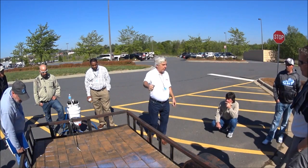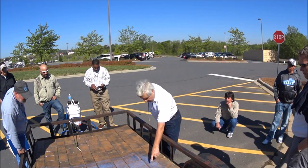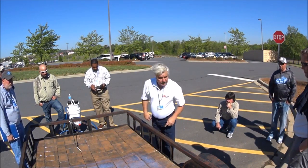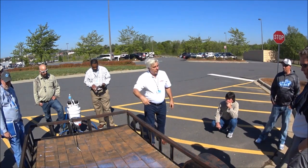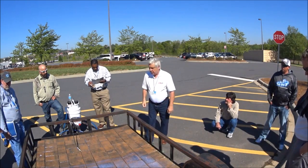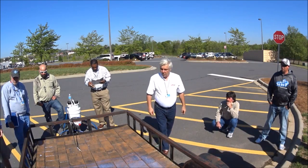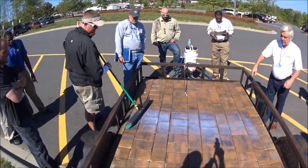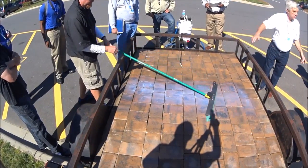When I'm doing my second pass, if I am, or I'm sealing this paver here, say I put as much sealer on this paver, and that paver is more porous than the other pavers. So I got to treat that paver. I got to get a little more sealer. And I might give it a little broom. While it's wet, without getting broom marks like we did here, it's just the head weight of the broom, one shot. That's it. Done deal.